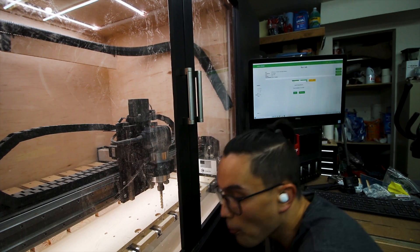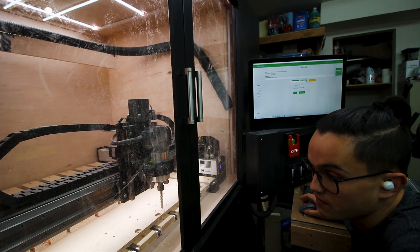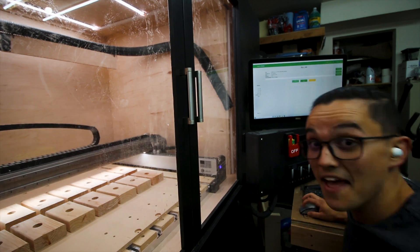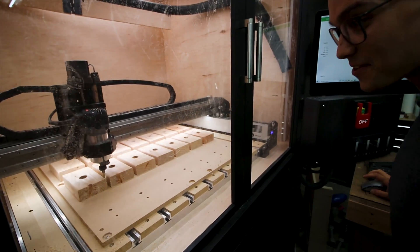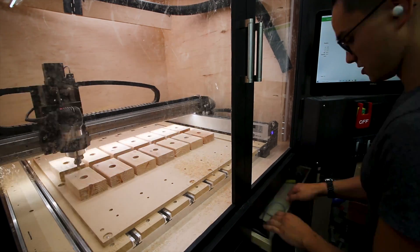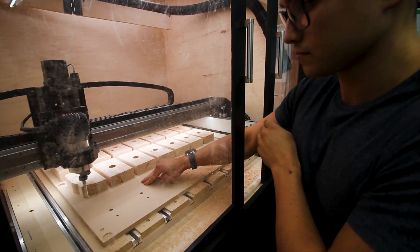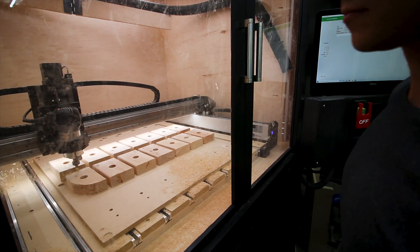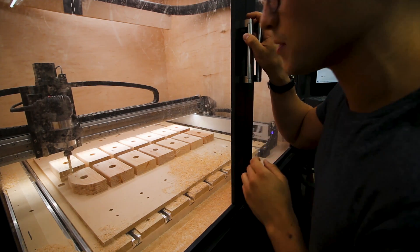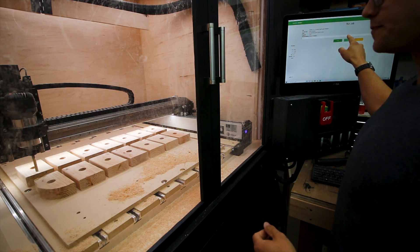That's about all she wrote. I don't have a whole hell of a lot else I can do other than turn on the spindle and let's hope this first one works out. I have 100% feed rate. We're successful so far! Okay, we have a slight issue and that is lifting of my fixture plate. I'm gonna go ahead and drop in some M5 bolts. Got her bolted down. We're gonna go ahead and fire back up, get back to cutting.